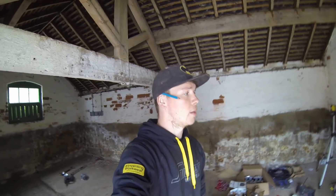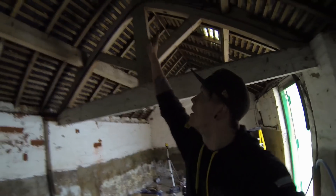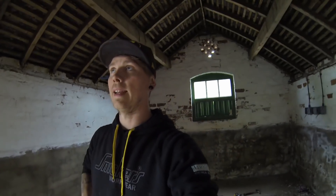Ring circuit's done now with the armour clipped across from the board, down, up across, done the run above me, across down to here, back again straight to the board. I'll get the board glanded off and we'll go from there.